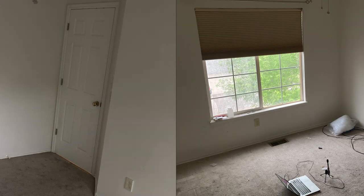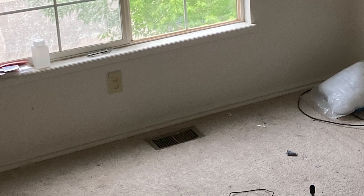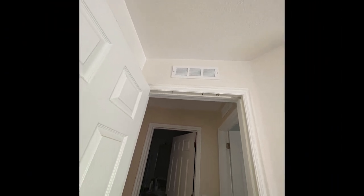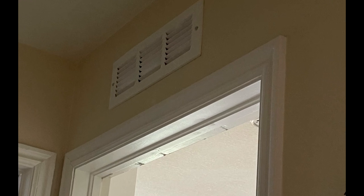Let's take a look at all the weak points in the room, where sound is most likely to enter from. The most obvious ones are the door and the window — they are much thinner than the walls, and anywhere air can go, so can sound. So those cracks around the door are a big problem. The other obvious concern are the vents. There's an air vent in the floor connected to our heating and cooling system, and one over the door leading into the hallway that was put there to allow for better airflow last year.